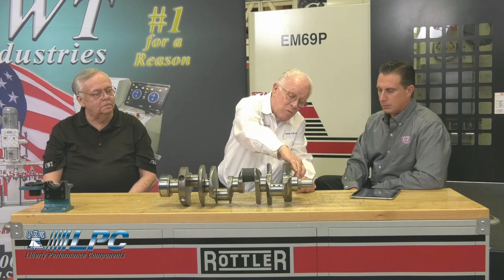Like this one Randy did, and if you see the outside, there's a little bump here, because this wouldn't be what we considered finished. You rough cut it, and then you hand finish it so you don't feel any edges here, because you want the air to hit, track on the side, keep close to this weight, and then on the back side of the counterweight, we want that absolutely square, and it releases off. These are like aerodynamic principles that are happening inside the engine at speed.